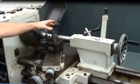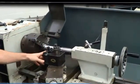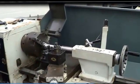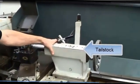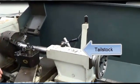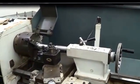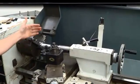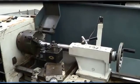On the carriage, we also have a tool post which contains your tool holder and your tool. You can adjust the height of the tool and the actual angle of the tool. We also have a tail stock, and the tail stock is used either for hole-making operations — for drilling, reaming, tapping — or just holding work between centers or stabilizing long shafts.